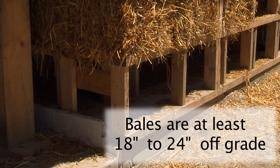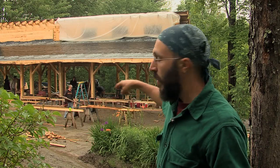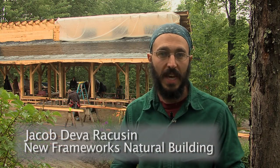We have a stem wall of the foundation that comes up to where those bales are beginning, above what is going to be finished grade. You'll see a double stud wall running all the way along the bottom perimeter of the insulated part of our structure — we're referring to that as a knee wall, it's a partial wall. The reason there are two stud walls is because they are built to accommodate the width of our straw bales, which are about 18 inches wide the way we're going to be installing them.